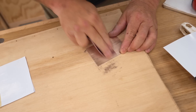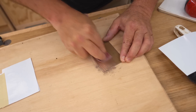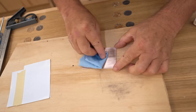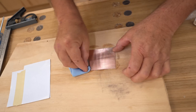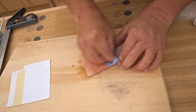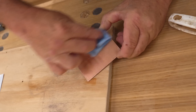The next step is probably the most crucial in this method, and that's to get the double-sided board really clean — I mean extremely clean. This can't be too clean. So what I like to do is sand it first with 220 grit. That gets rid of the grunge on the surface of these boards. Then I clean it very thoroughly with lacquer thinner. I use lacquer thinner because I've got a full gallon can of it, but acetone will work here as well.